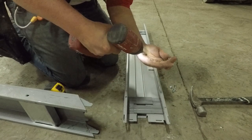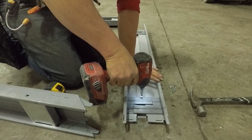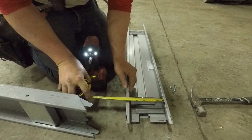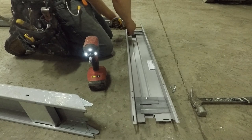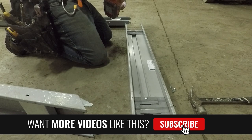The flanges are three-eighths on both sides, so you have to make your custom clips — that's covered in another video in this series. You want to have the opening at four-and-seven-eighths. I'm just setting the header width here, but the door jambs on the other sides are already done. I've installed the clips.